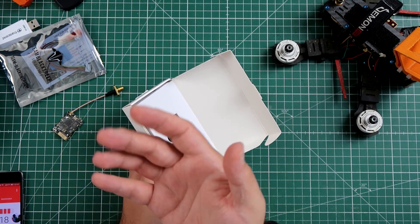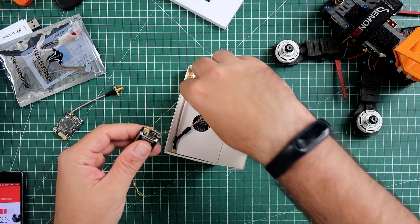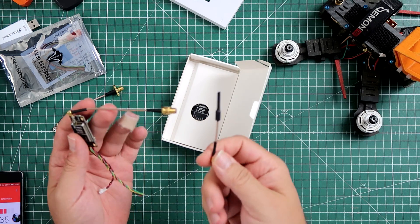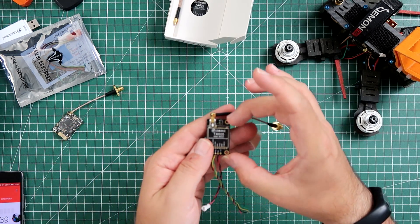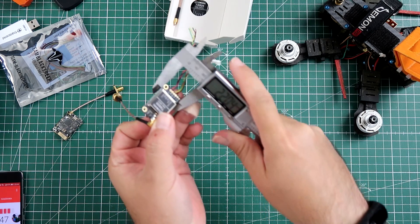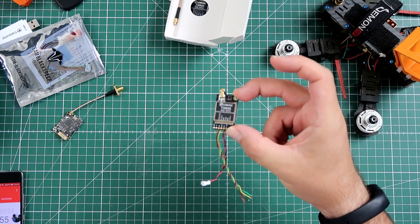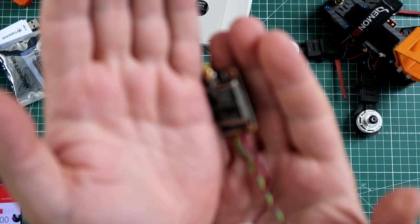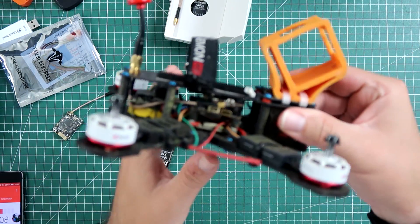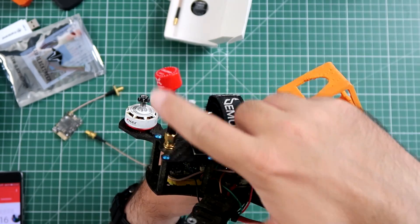What's in the box? It's a nice touch but it's a waste. It's a transmitter with an MMCX connector on the side and a small whip antenna, so you can just use that one. The form factor is 36mm by 22mm — half the size of a flight controller — but the mounting hole spacing is 30.5mm, so you can actually put it on top of your stack, just like I did here: PDB, flight controller, and on top the Eachine TX805 with the pigtail connected. This is experimental to see if it really works.